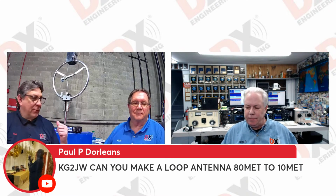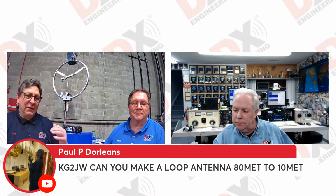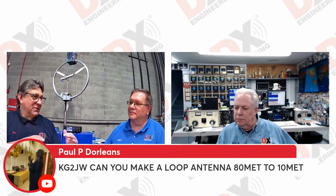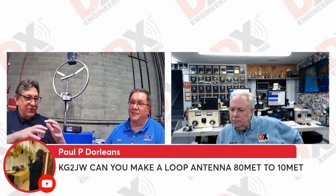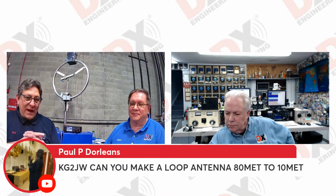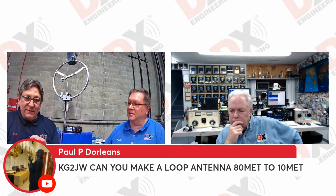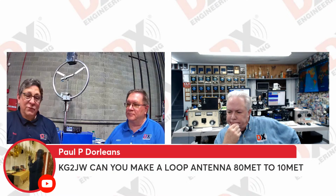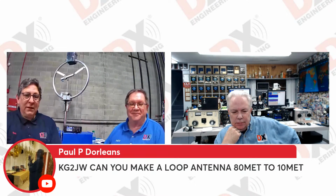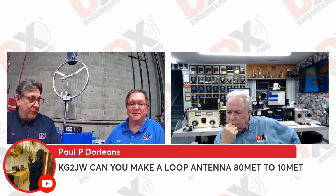For transmitting purposes, it's just not possible to make one that's large enough to work on 80 meters, but then small enough to work on 10. You just can't get the right tuning. And so the 3 octaves, the way that Ciro Mazzoni put it, can't be accomplished on this type of magnetic loop antenna. That's why folks buy 2. That's right. Yep. There's the MIDI for 80 through 20 and the baby for 40 through 10.